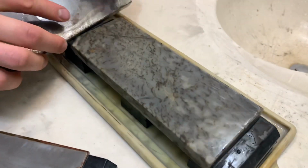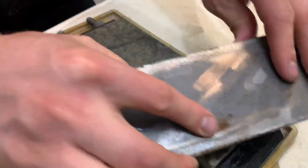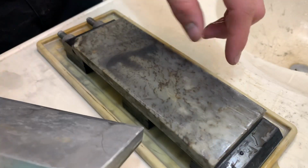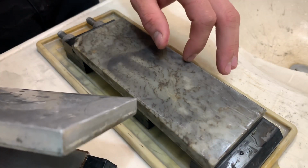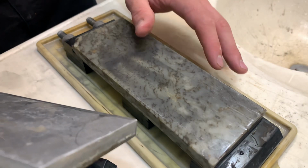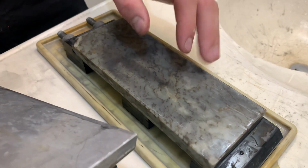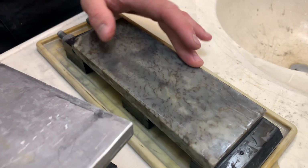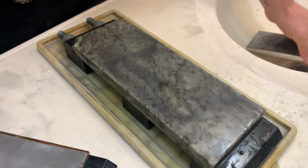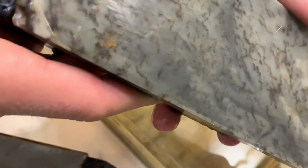Very quickly, the whole stone surface will start to eat up metal. And the reason that this happens is because this steel is a lot softer than the substrate. This concept applies to any knife that you sharpen. So basically, you have a very grabby but very fine, hard material in this jasper. So it's best as a finishing stone, but if you know how to condition the surface, it actually cuts quite fast. So if I tip this angle, you'll see all the metal.